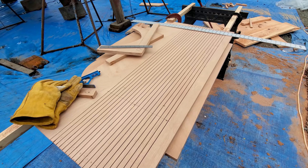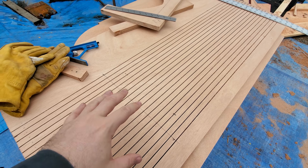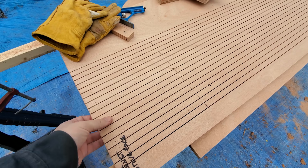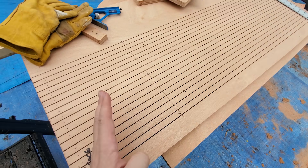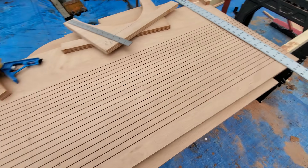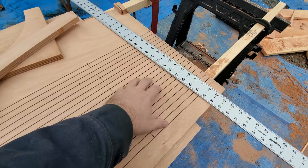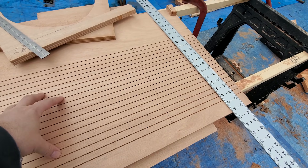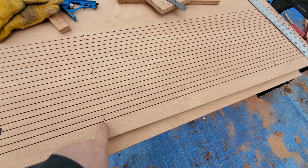You can see we've got the cuts made. I'm marking out where the door is going to be — I centered it so we can take a little bit off each end. That way anything on the ends that gets screwed up from clamping won't matter. We're really concerned with the center section. I'll cut this down from each end to make it the right height and ensure it's square. This end has to get contoured to the hull, and this other end has to be set up for the sink.